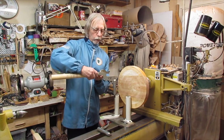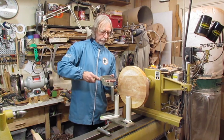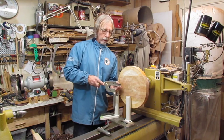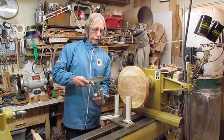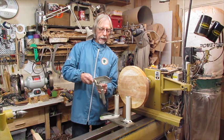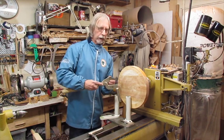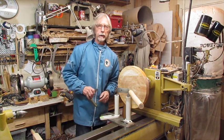Normally, if you were to just try to take a core with this only, once the knife gets really far into the core, there's a lot of torque and a lot of pressure down there. So the one-way system has this support arm or the support finger, and the knife follows that around and supports the cutter when it's inside the core. So that's really the key to it. It makes it a lot less drama, let's say.